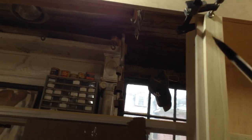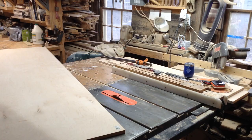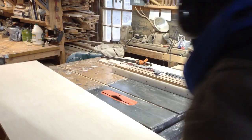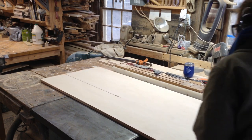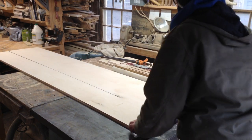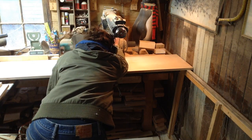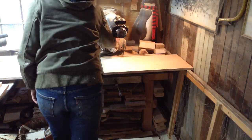I can have the panels on hand in the space, try and install most of this on the first day, make all of the marks on my panels, cut everything on my table saw in the shop the following morning so I get nice clean cuts, and then reinstall that stuff in the space. So this one, I did cut this one to height because the height shouldn't change. Famous last words — it shouldn't change, it could. But the height from the rustic panel to the top of that piece shouldn't change. So I cut this to height.